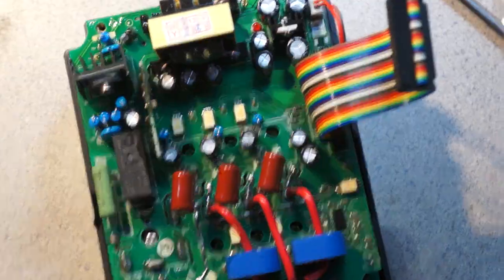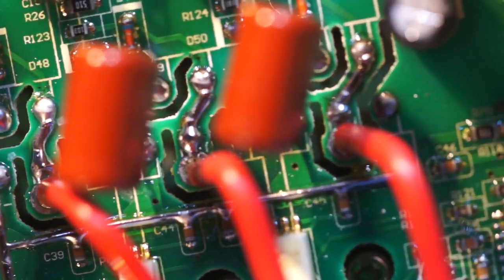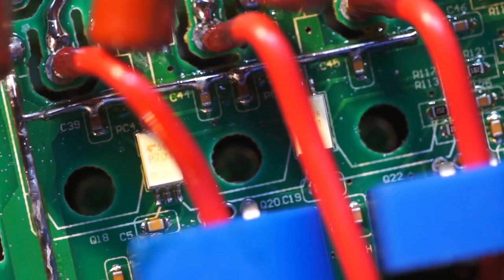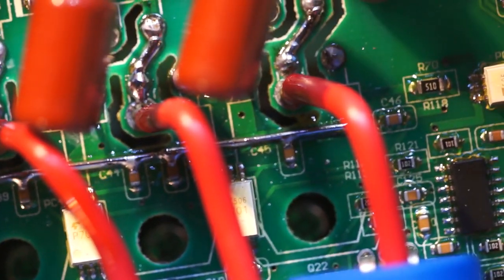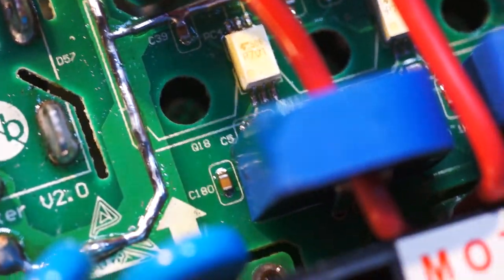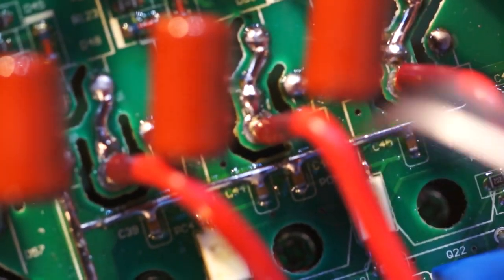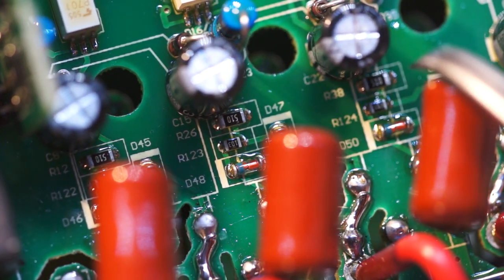So here we're looking more closely down there. Look at those little caps tacked on there. It looks like they've soldered wire onto some of the exposed copper traces, presumably for current handling capability. My assumption would be that this connection here is going to be one of the mains edge ends. So these are obviously your outputs, so this can be pulled high or low. So I would assume there's another big power rail somewhere up in this area, maybe on the other side of the board. Yeah, it is. I don't know how visible it is, but if we look down there, you can see that very large power trace. So that's going to be the other power rail. See if I can't convince it, let's see if we can read the part number.